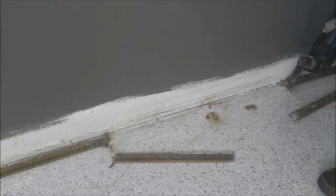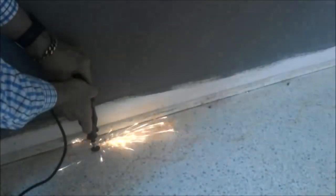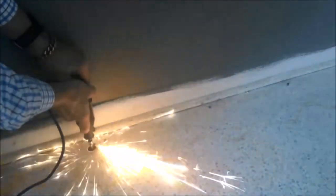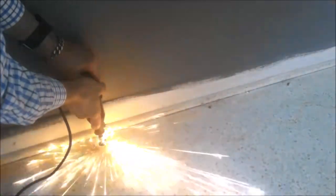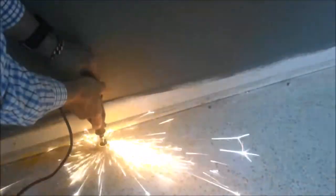The next tool I'm going to use is the Dremel. Once I get all the tack strips out, you can see the heads of the nails sticking up. I take that Dremel tool with the fiber blade and put it as close to the edge of the floor as I possibly can. You need to be wearing safety glasses because sparks can bounce off the base trim or the floor. It's really neat to watch all the sparks — it almost makes you look like you're working in some industrial shop.